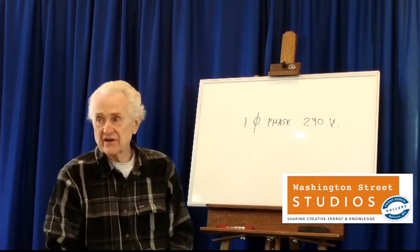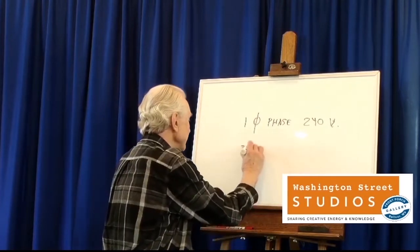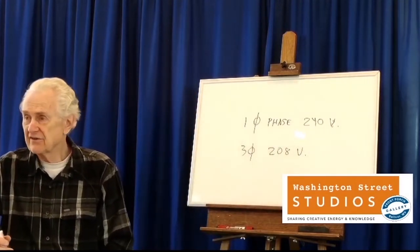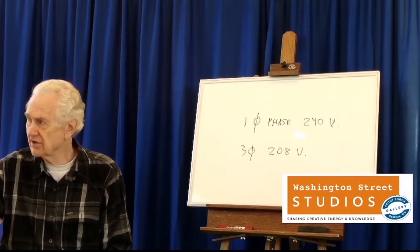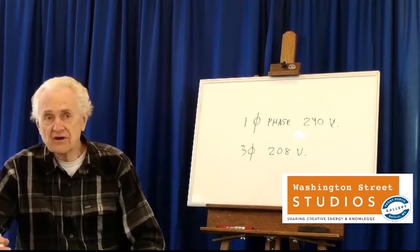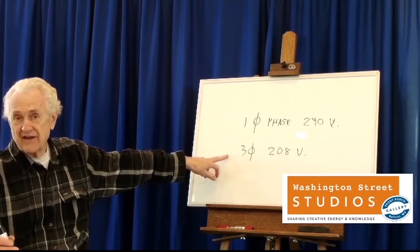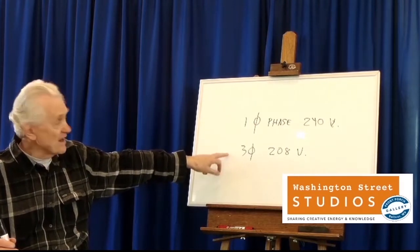But there are also kilns out there that were designed for industrial or commercial settings, and those are three phase 208 volt. And they're not completely interchangeable. A lot of schools and businesses, especially industrial and commercial applications, have three-phase 208 volts. For high usage of electricity, this is actually a less expensive, more economical form of electricity. And that's why a lot of businesses, heavy users and industry use this, if not even higher voltage.